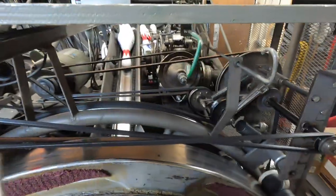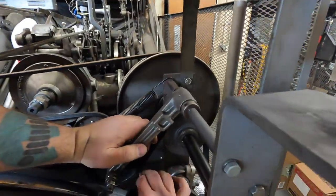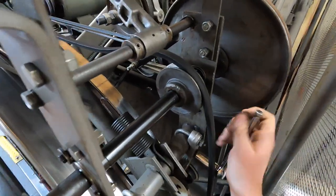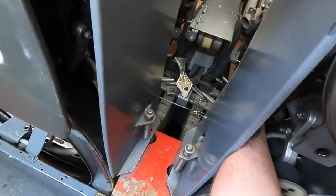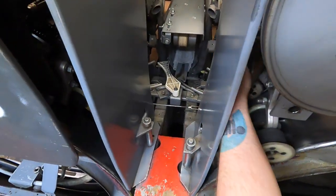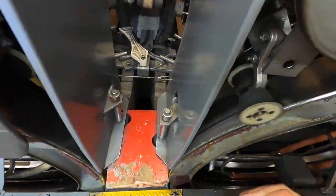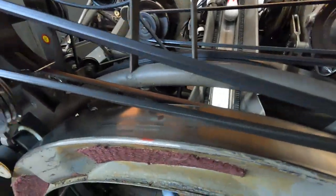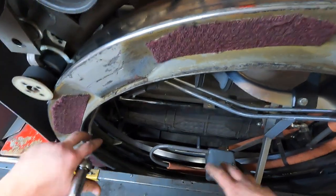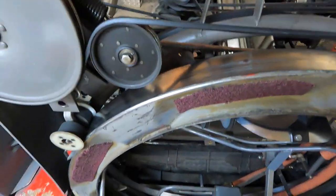Next would be the ball wheel. In the ball wheel, you have to take tension off the belt. I'm going to loosen the U-bolts. The reason that we take tension off the belt is because sometimes you'll get the ball wheel floating around, and taking tension off will kind of let everything sit down like it's supposed to.